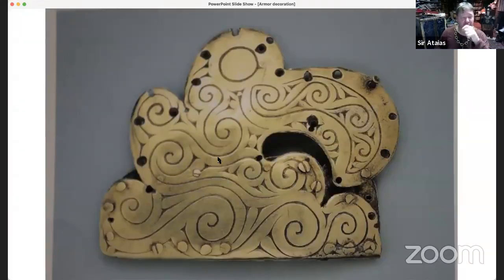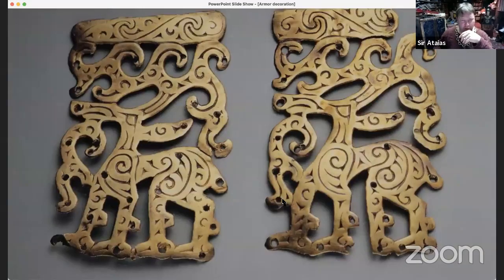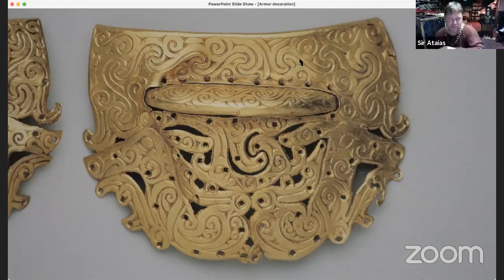And that's where you're taking a sharp chisel thing and you are removing metal rather than just pressing it in. So on this, you've got these kind of marks, these kind of lines. There's other pictures that look better. Yeah, this is where you see more engraving, where you're actually removing metal with this sharp edge or point, and you're gradually going along removing metal. That's where you get these channels, sharp, shiny channels rather than just some lines that have been pressed into it.